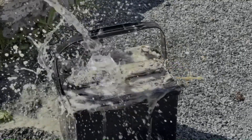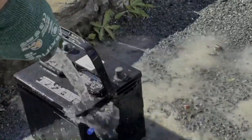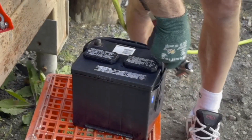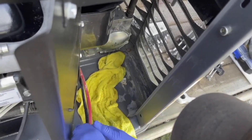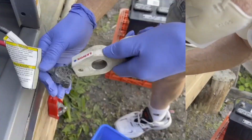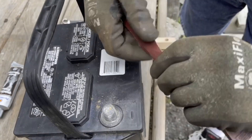Now that the acid has been neutralized, wash off the battery in a safe place. Even though this is a battery on your generator, this could be one on your car, and all the procedures here would be exactly the same. Most Generac dealers will recommend changing the battery every four years. Once you've finished rinsing it off, give it a wipe down — I was lucky enough to have a compressor close by and blew off any excess water. Before you put the battery in, wash out the battery tray compartment thoroughly. All you need is a rag and some plain water. One last clean up with the three-quarter inch fitting brush, then go over the post one more time with some plumber's sandpaper, which works really well in this situation.